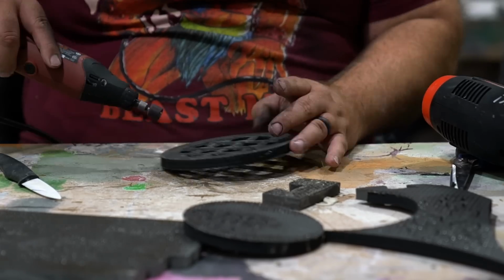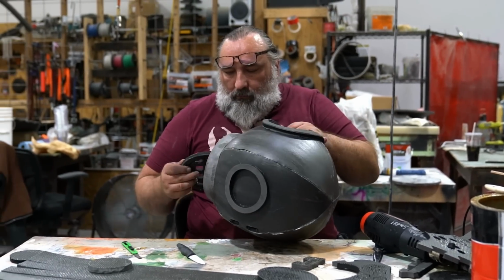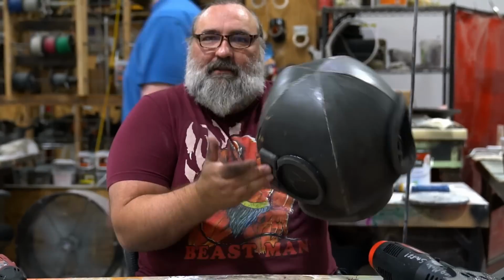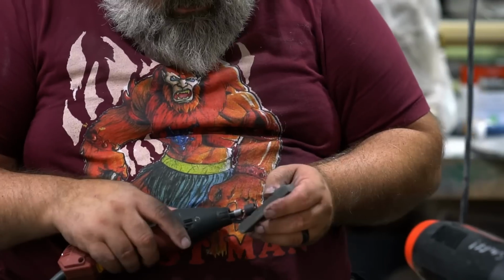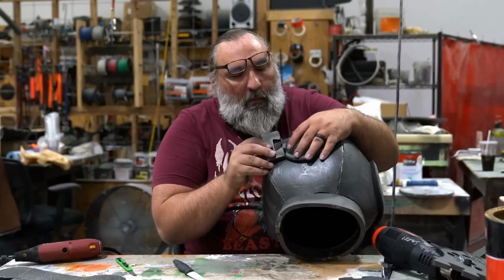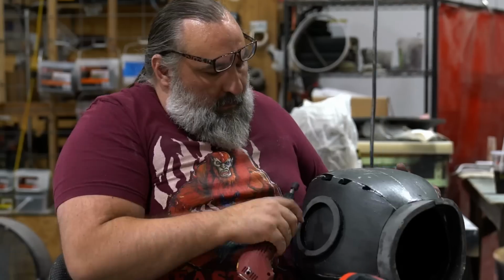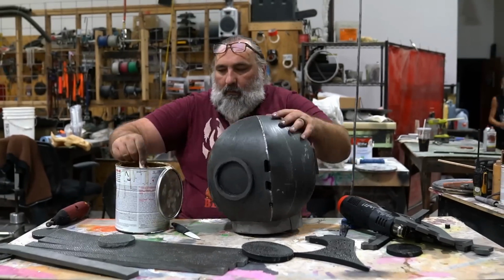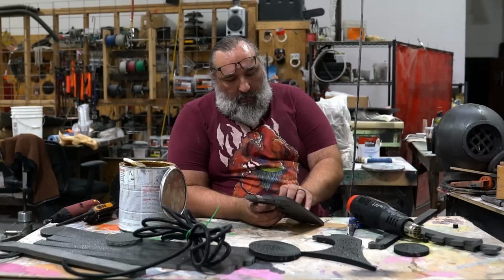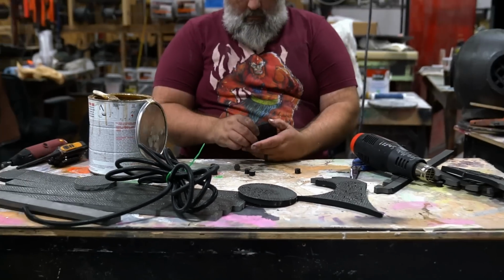Every rough corner, every cut corner needs to be dremeled a little bit. It's amazing what a difference that makes in the look of things. And I'm actually putting this grate on the inside. So I beveled that interior, and I'm going to bevel the outside, the corner of this one, so when it goes in, it sits flusher, more flush. And you can look at that, and that is the piece that I cut off, the piece that was misdone, and that makes a nice little hinge if you put them together.